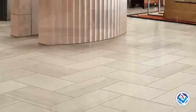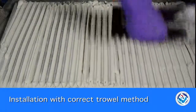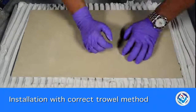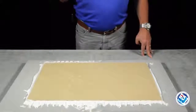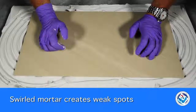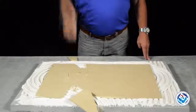Porcelain tiles in particular can withstand extra heavy service conditions. It takes a lot of impact or point load to cause bond loss when installed correctly over a sound substrate. The mortar under this tile was installed using the correct trowel method — no error here. On the other hand, since tile is a hard and brittle finish or veneer, unsupported space under the tiles actually creates weak spots. That same porcelain tile may be easily damaged by the same impact and heavy loads.